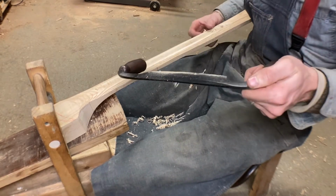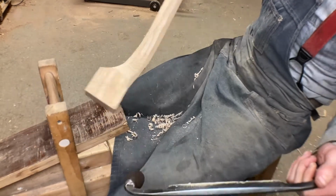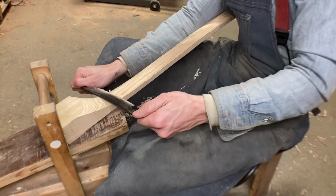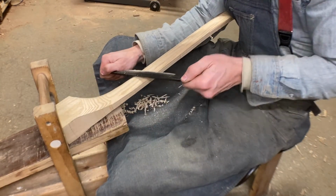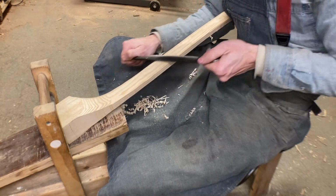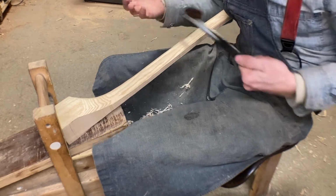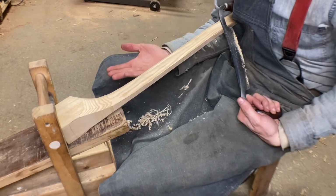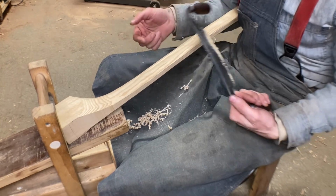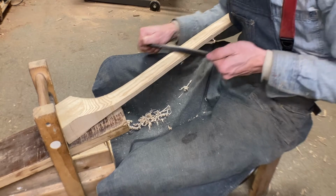That's that low spot, so I'm going to be careful right here because we're not really committed at that point. Pretty flat grained right here, and what I mean by that is, as you get low, and anything that's flat grained, as you get underneath it and then you pull back up, you're actually going against the grain when you pull back up. So you have to be careful when you're running into some pretty flat grain stuff.